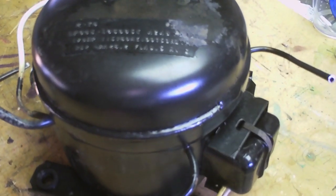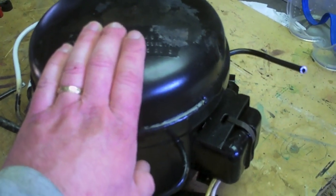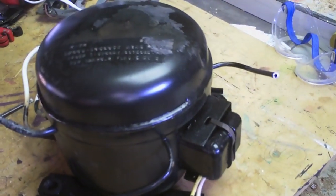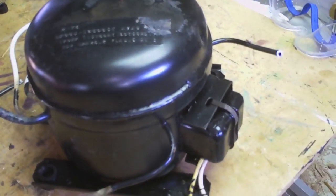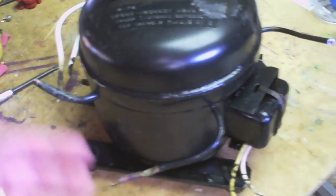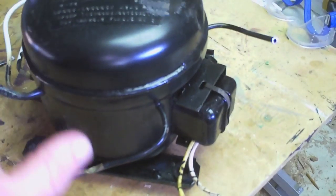This is something I've been wanting to do for quite some time, and that is turn an old, large, freezer compressor pump into a high-pressure air compressor. Couple advantages. For those of you that don't have a whole lot of high volume, these things are dang near free, and they're almost completely silent. That's nice, especially if you're airbrushing or something. You port this into a big tank, get yourself some pressure regulator stuff so you don't go over, say, 135, 140, 150 psi. Turn it on in the morning, half hour later, because they're kind of slow, tank shuts off. It keeps up with you for the rest of the day, and you can have a conversation over the noise. I'm not after that, really. I am after just the raw, high PSI.